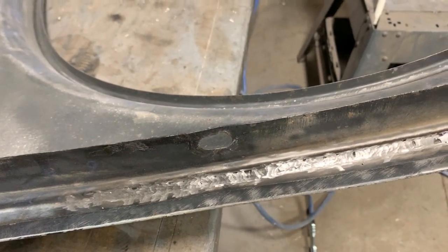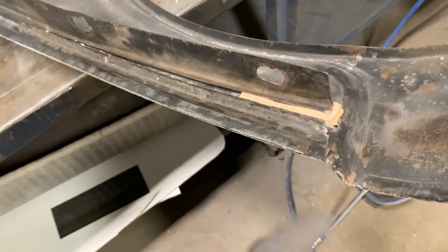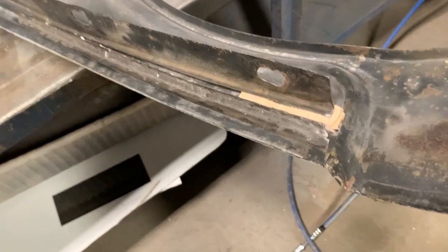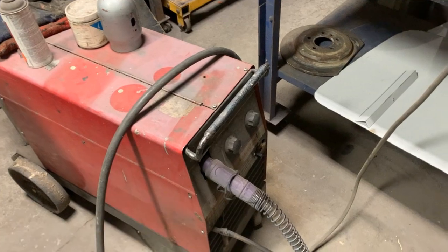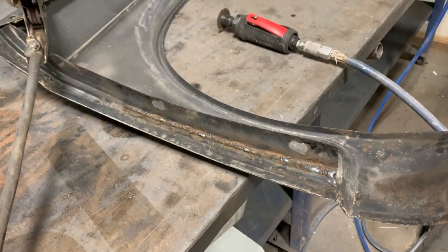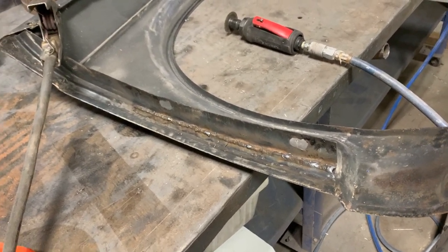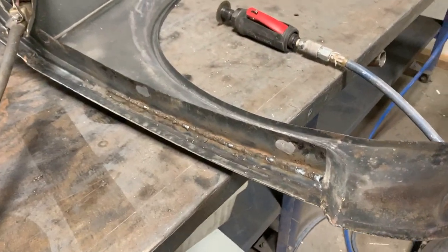Here's our incision made. I think this is how much we're gonna leave it open — I had to put a spacer here because it's trying to collapse. I'm gonna just tack it in a few places and then figure out how to fill up this gap and that's gonna be it. It's actually really easy with this big welder to fill big gaps because it uses a very thick wire. I got used to my little welder at home with 0.025 wire, which is much better for little welds on thin sheet metal, but for filling big gaps there's nothing like this big one. Anyways, it's ready — let's grind it and test it.